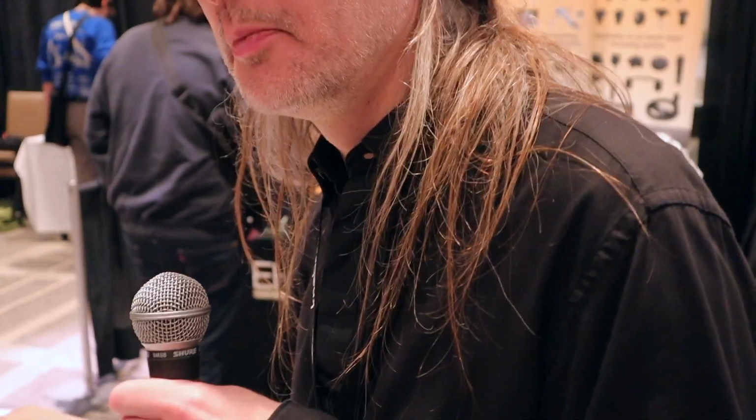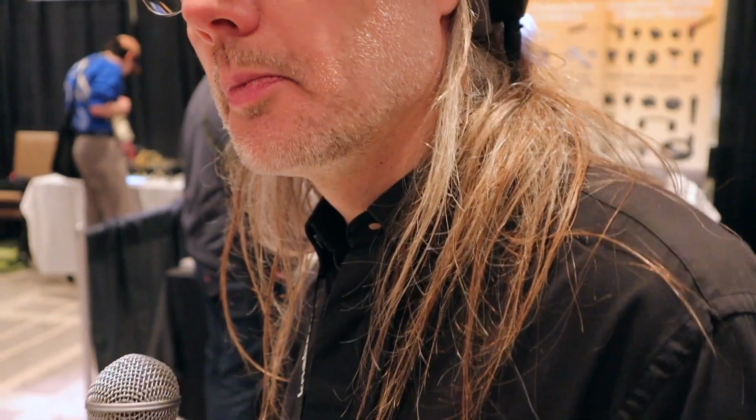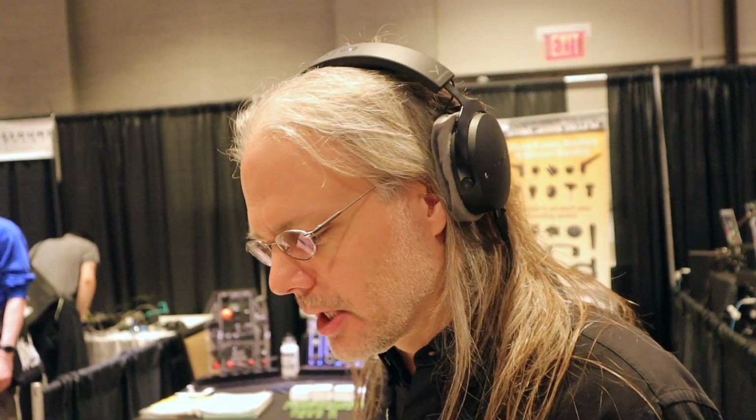Like the self-regulating idea, the idea of this tiered modulation and control and macros, I guess what's led to your designs? I do some generative, some drone things on my own. I don't sequence much, but I do look for ways to find rhythmic structure outside of sequencing. So another thing I do with the crossfaders is they are CV capable. They're DC coupled. Okay. So you can feed LFOs at different rates and different shapes through them and then put that to a comparator. Okay. Evolving. Trying to kind of like phase lock and loop almost. Yes. Unsynced sources.